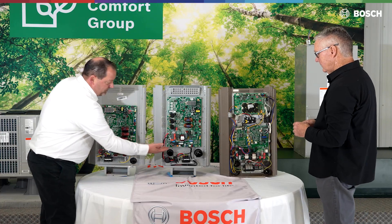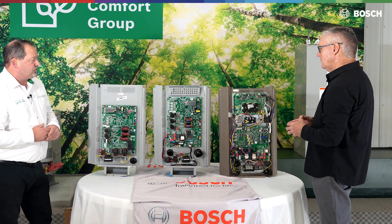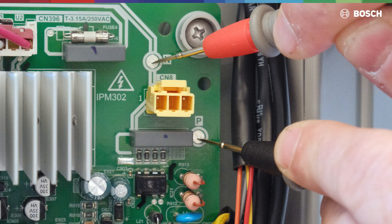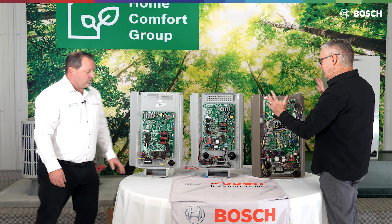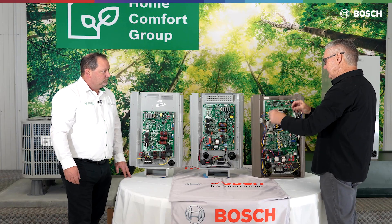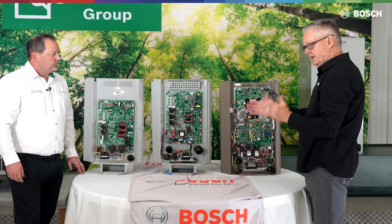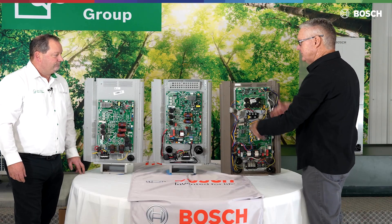We had some additional sensors added to it along with that crankcase heater, so the design of that board has changed a bit. Another key point is checking the DC volts on P and N — we now have an easy connection spot right up there. So we can get our meter leads on that. If we pull the disconnect and the screen goes black, the book says to get our volt meter out and take our DC volt meter between those two points — P and N. If it's less than 42 DC volts, the board has discharged itself and there's nothing in there for us to discharge.